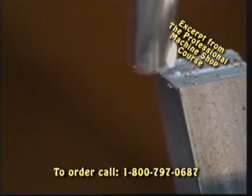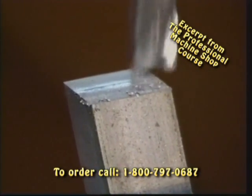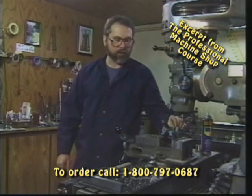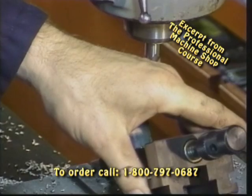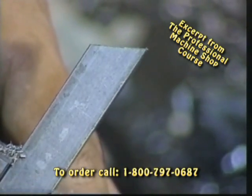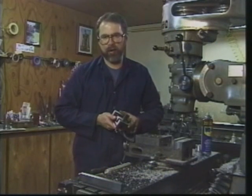We're not using any cutting fluid on this particular job. We're machining a leaded type material that machines really well. There you have it — we've surfaced that at 30 degrees, done a real nice job. We've shown you a little different type of material: that was a piece of steel, 11L17, a nice piece of free machining leaded steel. Turn it on the side there and you can see the angle that we've machined on it. So you can see the versatility of having a couple of vises around and how to mount them in our main vise.